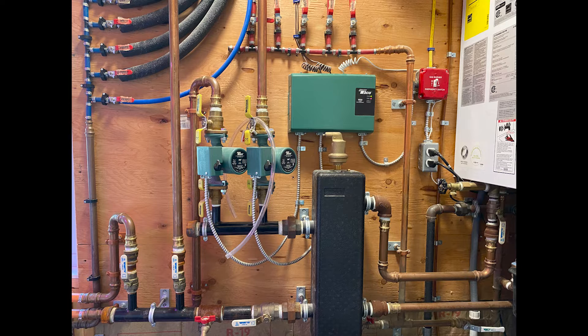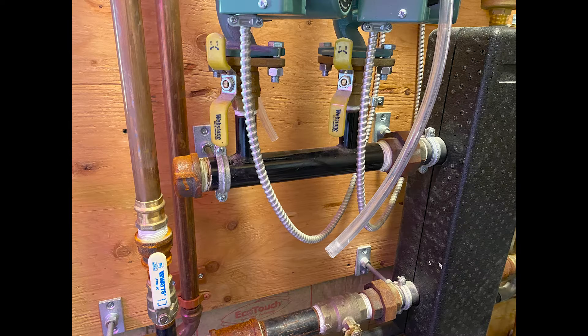I don't have a lot of space here and I want this to be laid out well, so instead of cobbling on another pump at the end of the line, I'm going to remove the two-way manifold and replace it with the three-way manifold. It looks like the original installer didn't leave any space here for expansion, so I was going to have to move this return line anyway.